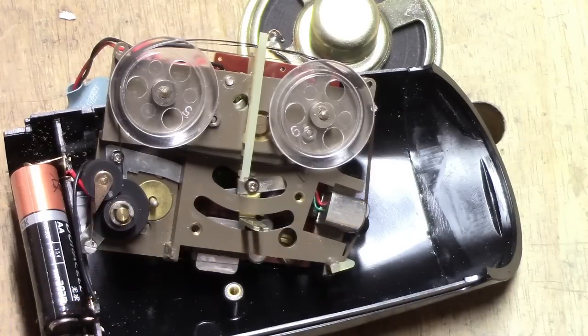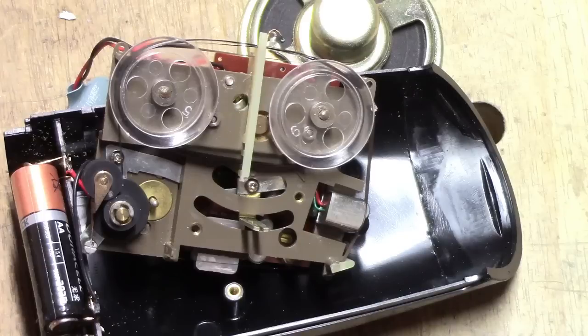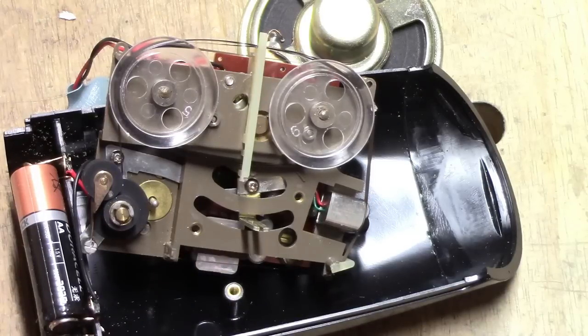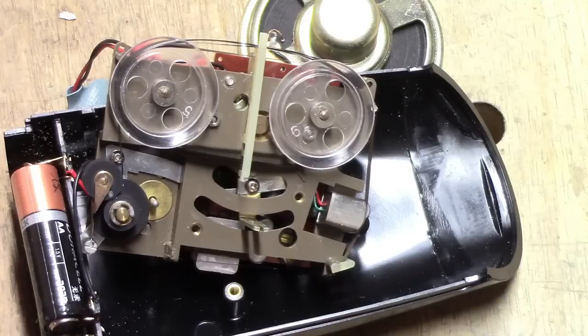The tape goes past the head here. They cannot possibly put a pressure pad in there and have it engage and disengage, so they simply have the head far enough out that the tape drags across it. This is a full-track recording, and as it goes around the head records onto the tape. Because it is an endless loop, you can obviously record over what you've started — so we have to be careful about that. The signal is strong enough that when the machine is running it just simply records over the previous recording. If you don't say anything, it just records blank, because the speaker — which you can see back here — is permanently attached and is also the microphone. It's a very ingenious design.